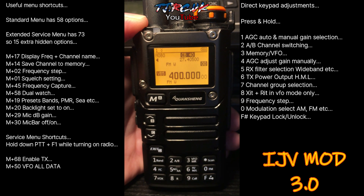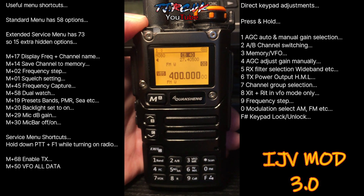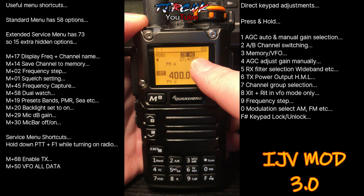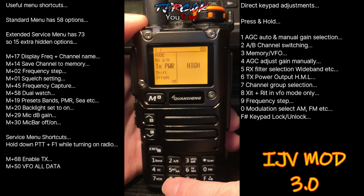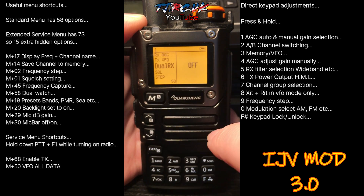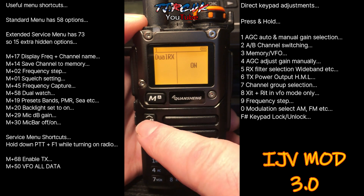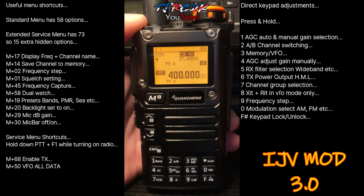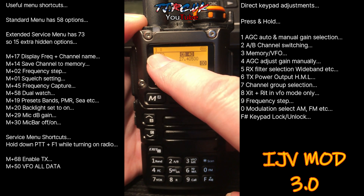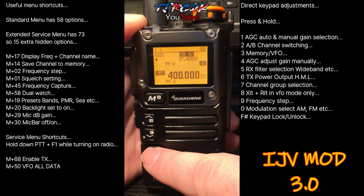The display layout has changed with the icons. You've got a speaker icon now, and two arrows which face down at the top for dual channel, or one arrow for single channel. If you're not in dual channel, you can press Menu 58 and you'll see the option. Press Menu, change to off and on. If you turn it on and exit, it's back — you'll have your two saved memories and it will switch between those. The speaker will show on the last activity.